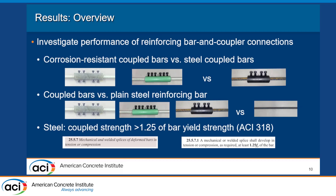There were a couple different ways we were going to evaluate our initial objective of these performances, and most of them were comparisons. We wanted to compare the strength of the corrosion-resistant couplers — the FRP couplers and the epoxy coupler — to the strength of a steel coupler, as well as the strengths of all coupler setups to just one plain steel reinforcing bar. And according to ACI 318, the strength of a coupled bar and coupler setup should be at least 1.25 times the bar yield strength, so we also kept that in mind.